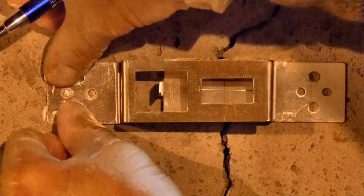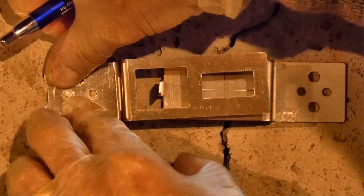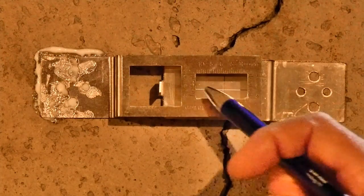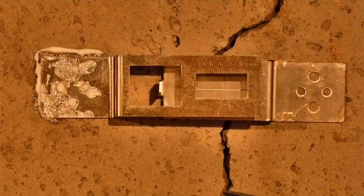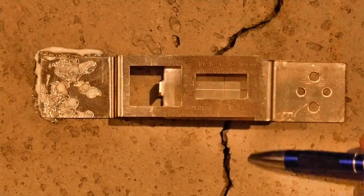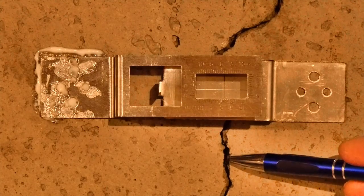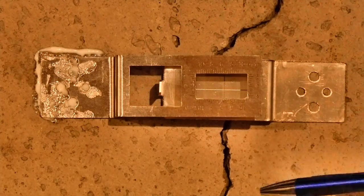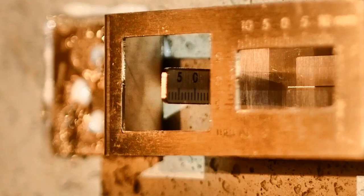I hold the top piece for another few minutes until it's secured. I've now installed the top piece on the other side of the crack and aligned the zeros horizontally and vertically — we're basically done with installation. The next step is to document movement. I'll show you how to take measurements in the Z direction, which is the depth movement of the walls — that would be the third plane.